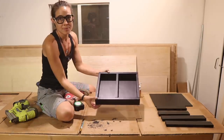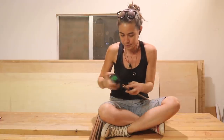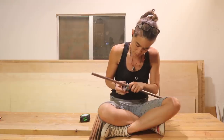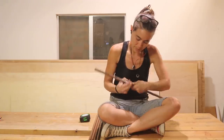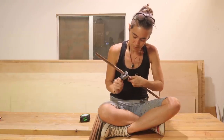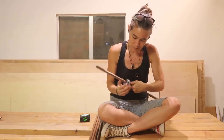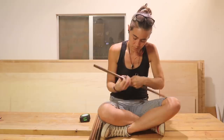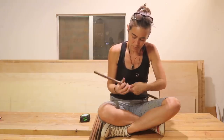A drawer! I then settled in to cut a lot of copper pipe, which is fine, because I actually really like cutting copper pipe. All you have to do is mark your cut line, and then use this little pipe cutter to cut it. The tool works by scoring the really soft copper, and every time you turn it around, you tighten it a little bit so the score mark gets deeper.